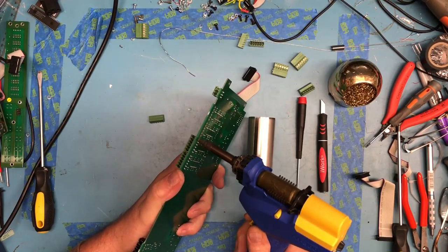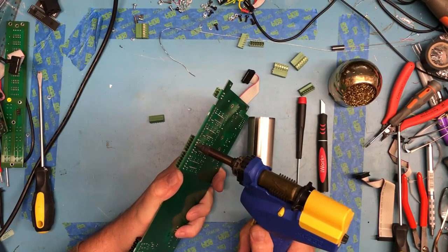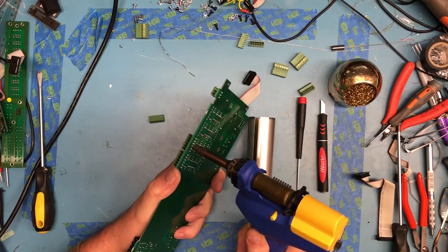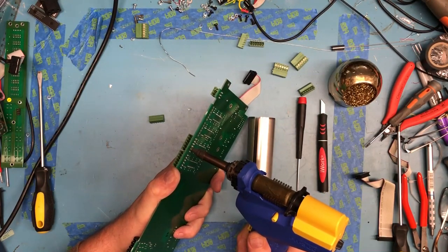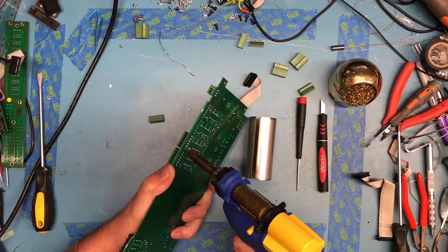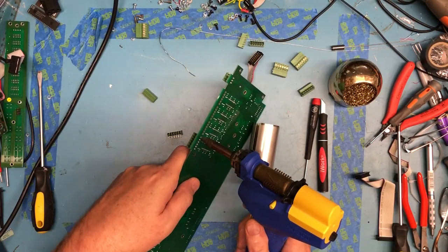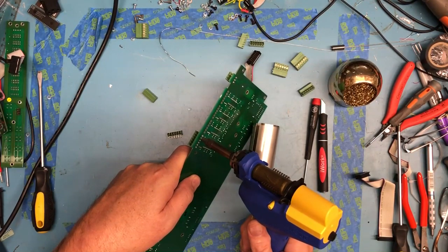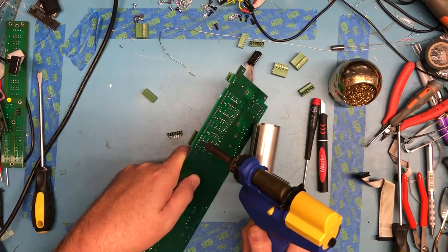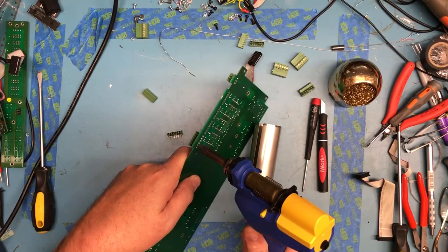You know, with those damaged, I really don't want to put them into my stock because they'll get soldered up to something and then I'll discover they're damaged and I've got to rework or whatever. So I have to spend a little bit of time to see if I can salvage them, or if they just are throwaways. It's just curious to me that the pins have shifted like that inside of these. I wouldn't have expected that. And this board was wave soldered. I just need to be able to take wave soldering temperature.